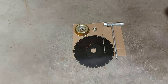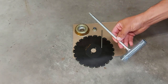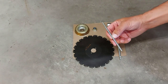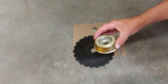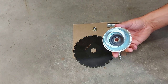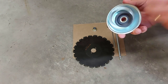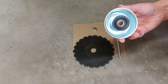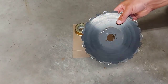So this is what we need for the job for installing this brush blade. We need this wrench. We're also going to need this — we'll call that a thingamajig. We're going to need the adapter cup. This is a brand new Stihl FS91 and a new brush blade kit. On the older kits, this washer here came separate — it wasn't attached to the adapter cup like this, so they've made it easier. We're going to need the locking nut and we're also going to need the brush blade.